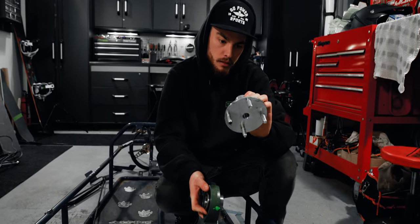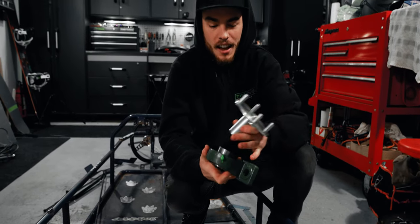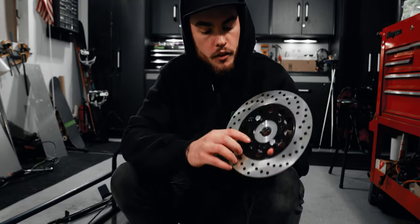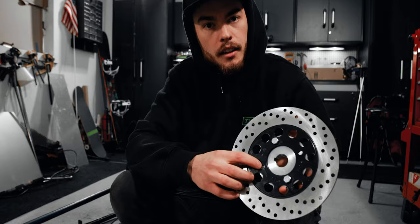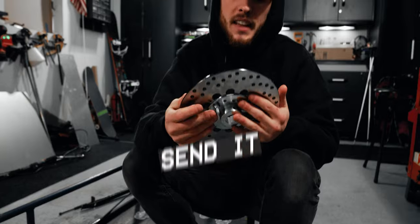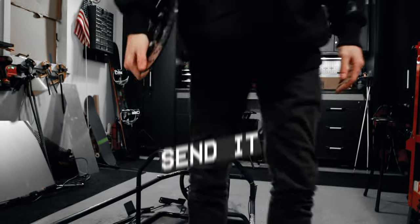It's in the mail right now, so by next video that we work on this thing, we'll have it. So yeah, like I said, I went ahead and just took a transfer punch to punch in a little spot right here for my drill bit to roll in. And I think I'm just gonna send it. Actually, you know, be prudent. Let's do a quick test.